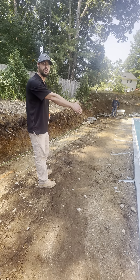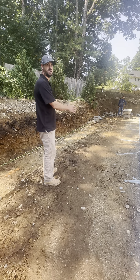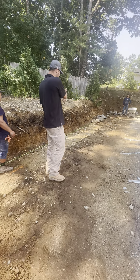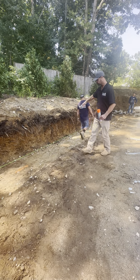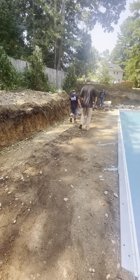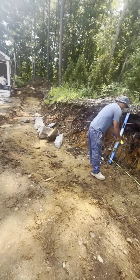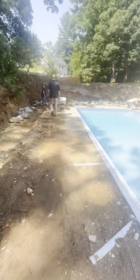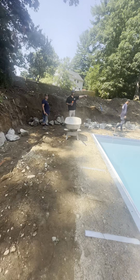If you want to do five feet of concrete, or eight feet, or seven and a half — you're still gonna have a foot and a half in front of the wall here. But it's gonna look nice because it's square, straight. Because if you do it at an angle, as soon as you pour the patio it's gonna look funny. I'm sure you don't want that.